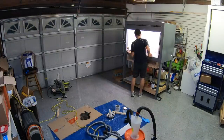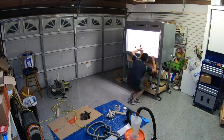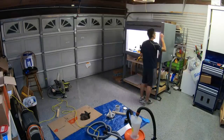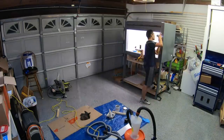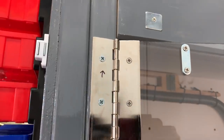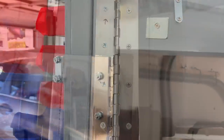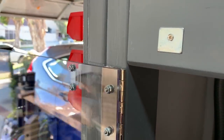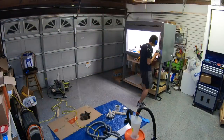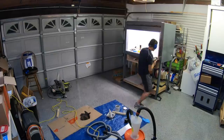Per McMaster's recommendations, I would be using number six screws to attach my polycarbonate panels to piano hinges that I also got at McMaster. I spec'd out heavier duty hinges because I wanted them to last. Cheap hinges will bend and deform just from installation, and with abuse and overextension, over time those ends will get dog-eared or loose — so I decided to spend a little more for the doors I would be using most frequently.